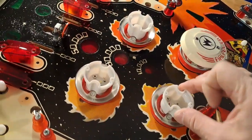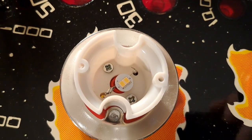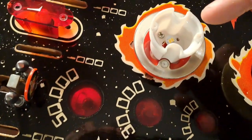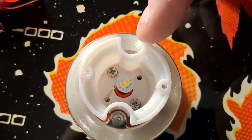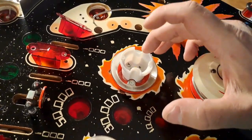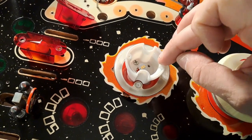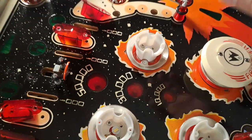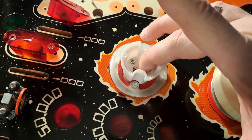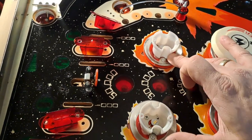What District 82 Pinball came up with was that he actually pulls the entire LED circuit board out of the socket, and on the backside you've got two leads — two wires — and those are basically just resistors. You solder a wire to each one of those resistors and then run it down through the holes underneath the playfield. That solves two problems: it gets rid of the socket so you don't have a friction contact with the bulb constantly going out, and it puts the light down at the bottom of the pop bumper body, which illuminates the whole body kind of like a lantern.